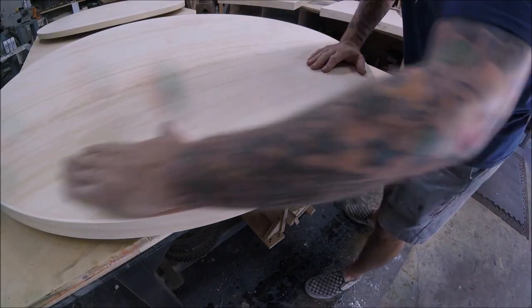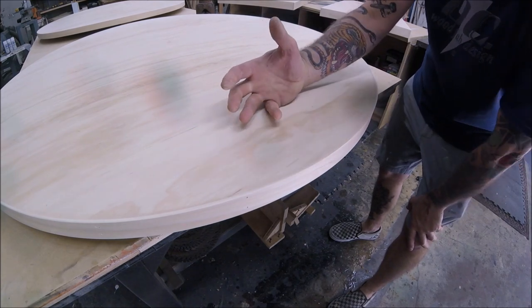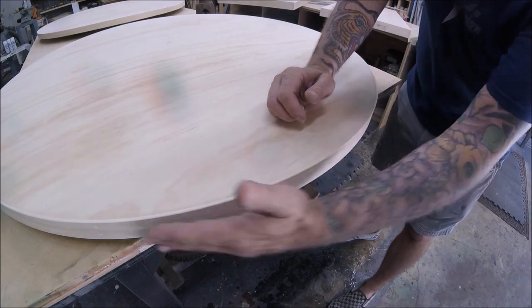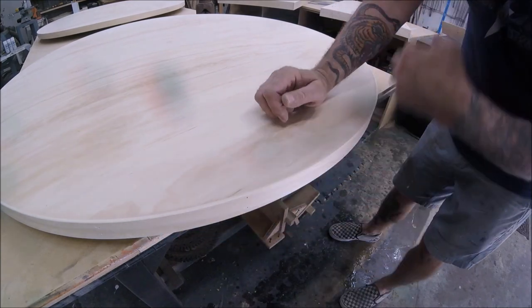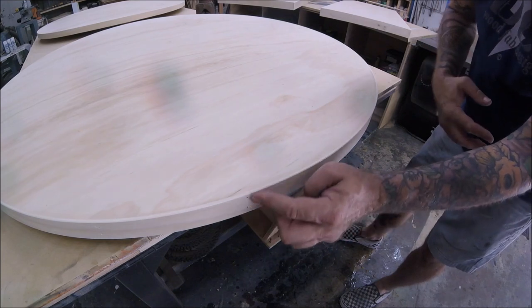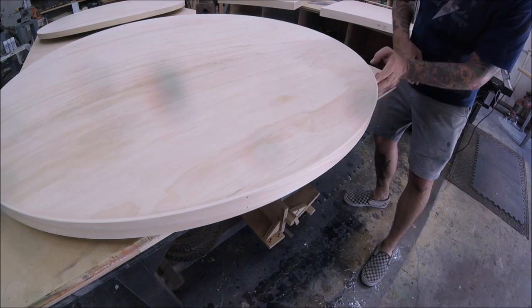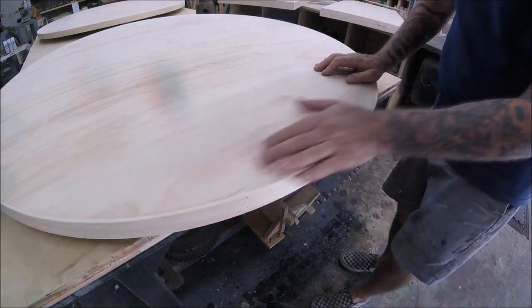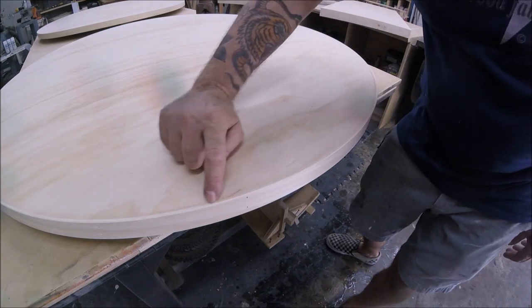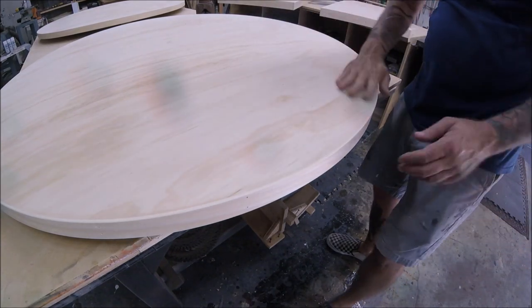When you get finished up, you can cut a piece of 1/8 inch trim on your table saw. So I usually get a 1x2. I get three 1/8 inch wide strips out of it, and it's easily pliable. Glue it down, start in the middle is what I like to do with a couple of tacks. Bend it around a couple more, bend it around a couple more, bend it around a couple more, and you won't have any issues. Now when you're done and the glue dries, you'll see little voids on top here. Just fill it in with wood filler. Sand it down, it looks really smooth, really nice.